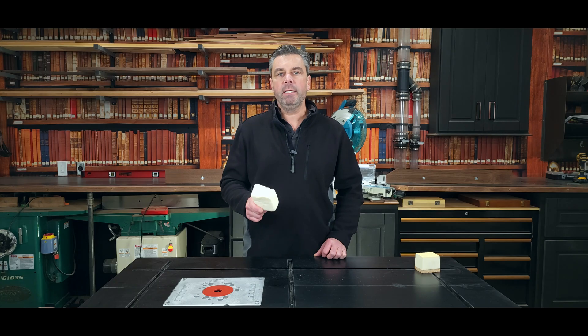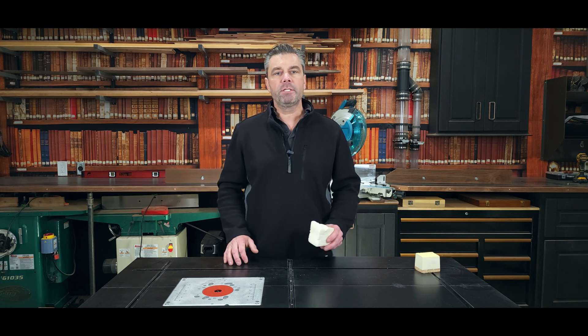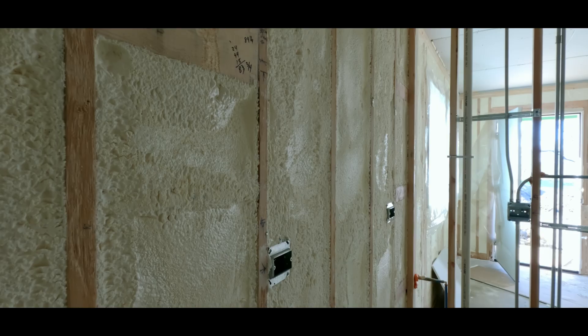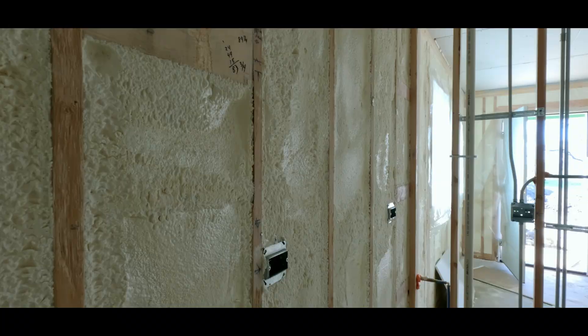Where this really shines is going to be more so on the sound dampening end. So let's say you have a tenant on the back side of that wall or maybe a cafeteria over there. If you were to have a contractor come in, spray foam the wall with half pound open cell foam and shave it flat and make it ready for paint, you're going to get a fair amount of sound dampening through that wall — it'll muffle the noises on the back side of that wall.